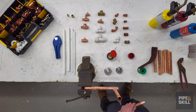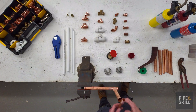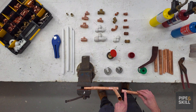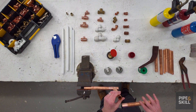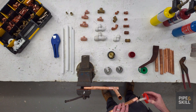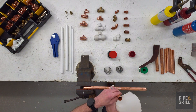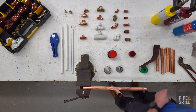If I solder two ends and come back later, two things could happen. One, solder could run from one pipe onto the bottom of that fitting and then I can't get the pipe in. Also, I'm oxidising it, so I'd have to give it a good clean again. And the third reason: when I put the last one in, I'm concentrating on that one, and the solder could run out or I could cause a leak in the two I've already done. So do the whole fitting in one go and then you can forget about it. When you push it in, you may get extra flux pushed out — that's fine, but good practice is to wipe it off, as it could burn and oxidise the pipe. Now I'm ready to solder.